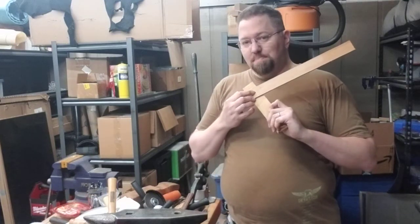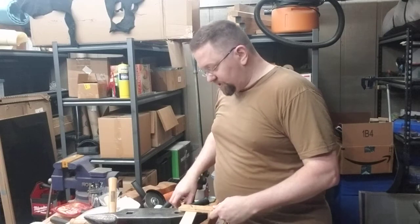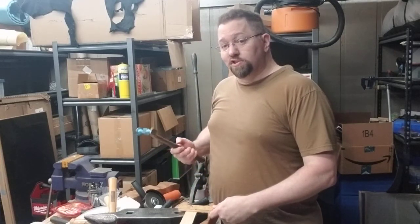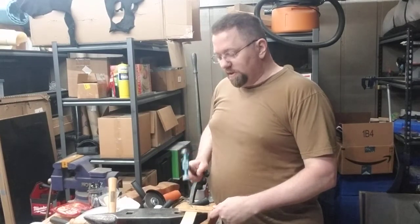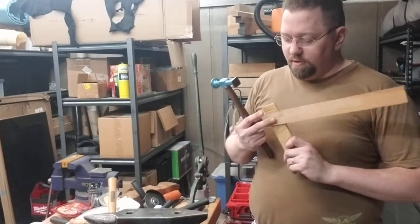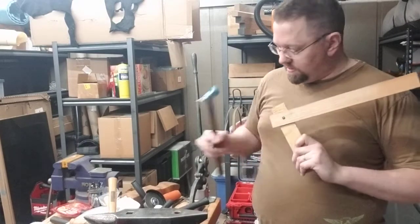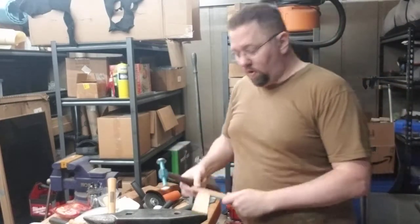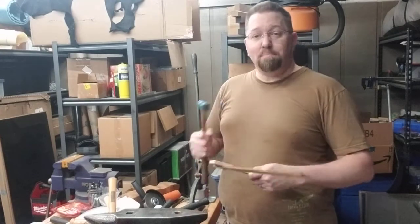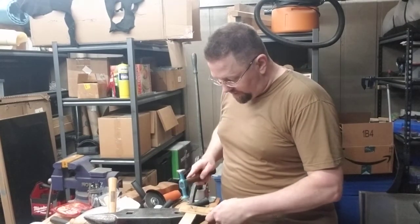It's important that you keep the head of the nail in contact with the surface of your anvil or whatever other strong thing that's under here. You really don't want to do this on just plain wood unless it's a very hard wood. You really want to get some sort of metal backing, because as we're working this, if we don't have something secure to hold that nail, it can just back out, and then we have done nothing of value.